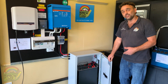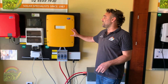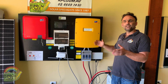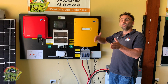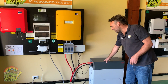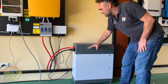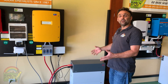A system like this comes with batteries — we're now using lithium batteries in most of our medium and large off-grid systems. For our large off-grid systems, Rainbow moves to a different supplier for inverters: a brand called SMA. We love these systems because we're able to modularly build them larger and larger, from about a four kilowatt inverter up to about a 300 kilowatt inverter, using exactly the same equipment from a household all the way up to a resort. These come with panels, inverters, an electronic distribution board, and BYD LVS batteries. These batteries are great because they stack modularly — a head unit with four kilowatt hour battery modules that stack, allowing multiple stacks for very large battery banks.